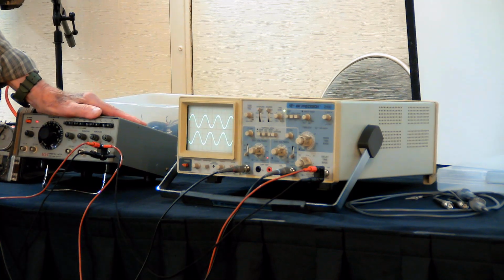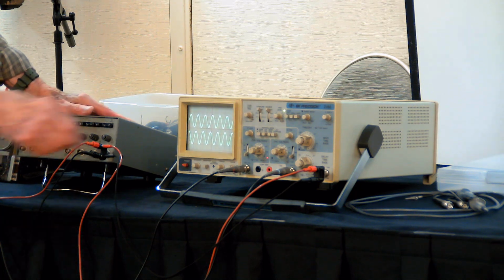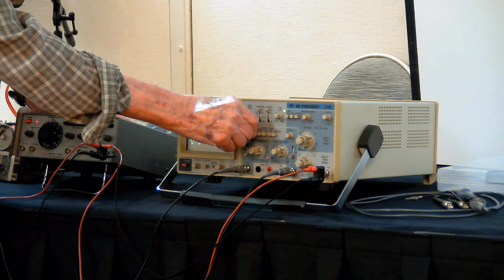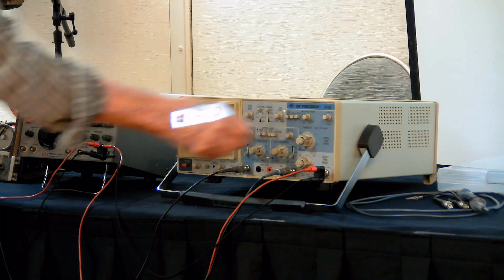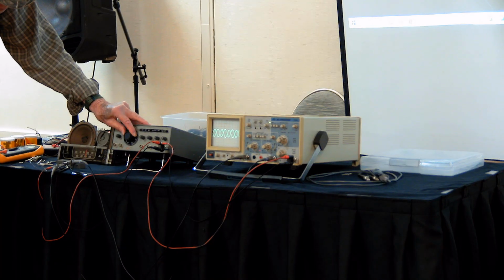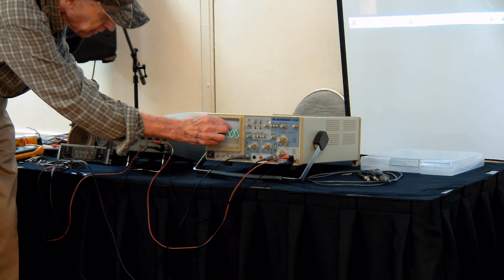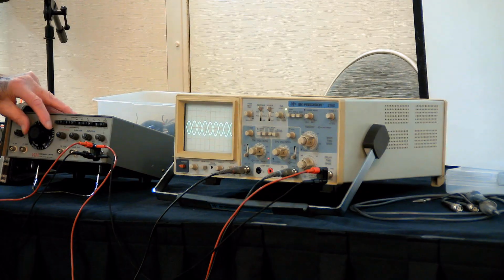they're both showing. And notice that they're in opposite phase from each other, and they don't stay that way. As a matter of fact, you'll see one is delayed compared to the other, and the way you can tell that is to move them both on top of each other. You see, one occurs before the other. And the amount of time between the two peaks is staying the same. And right now, they're exactly opposite each other.